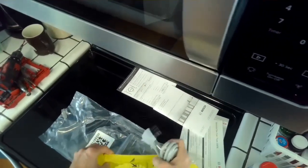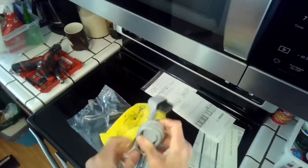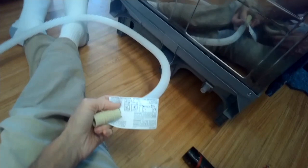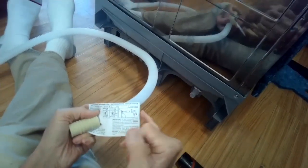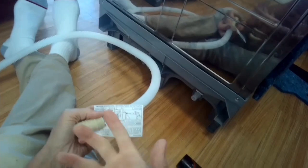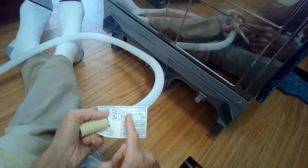This is your power cord — that just plugs into the back of your dishwasher, and then you plug it into the three-prong outlet underneath your sink. We're going to install the drain line right here, which is really easy. It does remind you that if you have a brand new garbage disposal, you might have a little plastic plug right there, so you use a hammer and a screwdriver just to pop out that plastic plug. If you've already had a dishwasher hooked up to your disposal previously, that plug is already gone — this only applies if you've put in a new disposal.